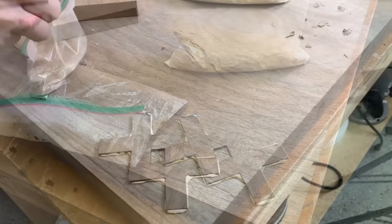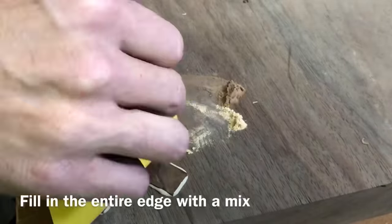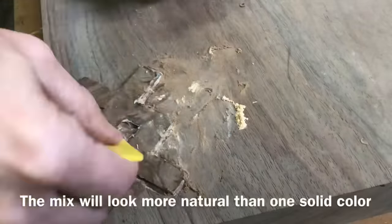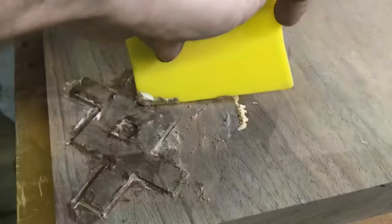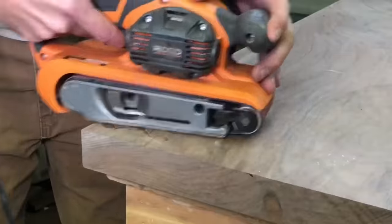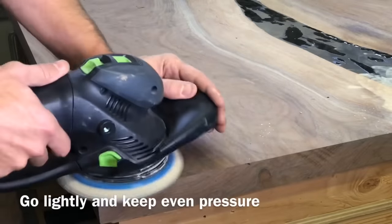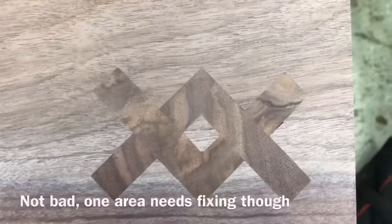Now that I got it in there, I'm going to show you my favorite trick for fixing tiny little imperfections — basically every woodworker I know does this but not a lot of people talk about it. This is elm dust and walnut dust. Most people use just one color, but I found that if I mix up the colors it gives more of a natural look, since color changes naturally in wood anyway — so there's not a solid brown line going around. This fills in the tiny little gaps that are inevitably going to be there. For bowtie joints I'll usually use my little block plane to bring these down to flush, but for this one with the weird grain I took my belt sander and then my orbital sander, going really even — you don't want to sand down any divots next to the inlay.